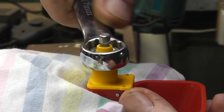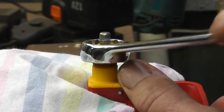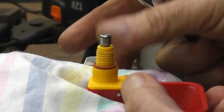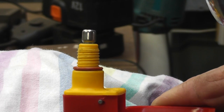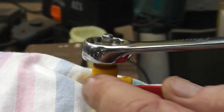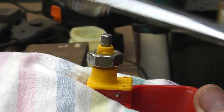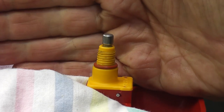That's pretty good - maybe a smidge more - then gently back that nut off. It'll come off easier than it went on because you're not forming the thread now. It's not quite as tidy as a factory-formed thread, but I've done this several times and it works. Put a tiny bit of Vaseline on the threads and run that nut down again - this time it puts almost no load on the plastic and just cleans the threads up. Once you spin it off, the threads should look a lot better.